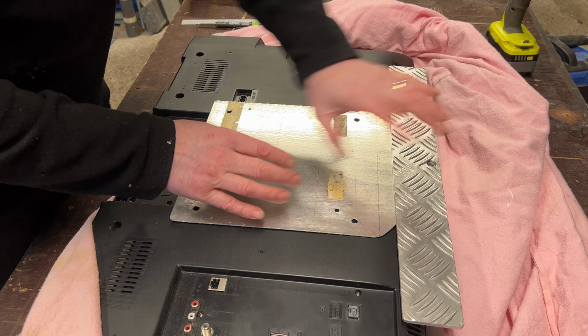Whilst that's not going to make a difference to the outside frame, what I intend to do is have a piece of wood on the outside frame as a lip, if you like, that's just going to come in over this framework of the telly. So I don't want to see one side bigger than the other. I want it equidistant all the way around the frame. So what I'm going to have to do is offset the TV a little bit in this frame, which shouldn't be a problem. It's just a couple of packer pieces and a little bit of hopefully relatively accurate measurements.